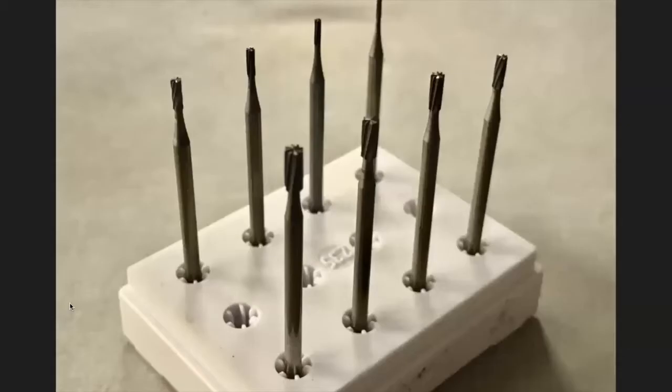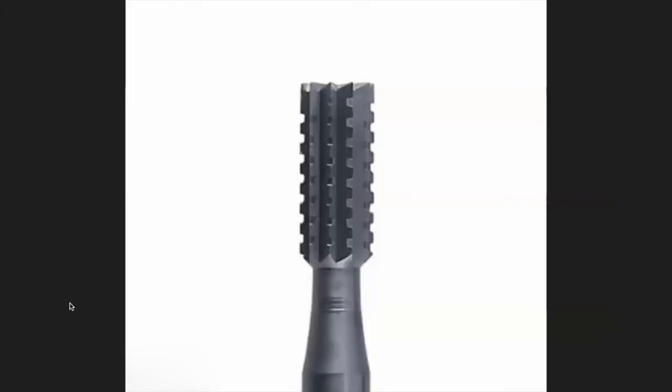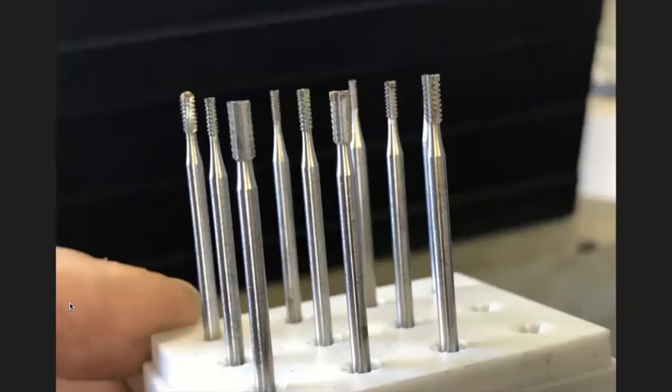For a set, I would not get the single cut — I would get the cross cut. You can see the difference: the cross cut has teeth cut in both directions and it's more aggressive, but I like that because I can get done with things faster. It's not expensive to get a cross cut cylinder burr set from Rio.